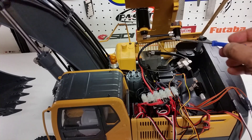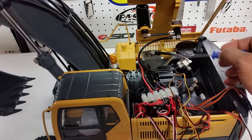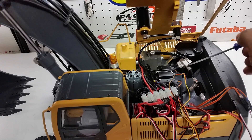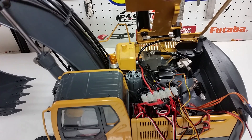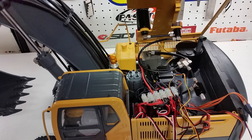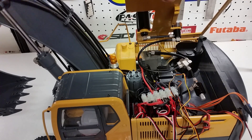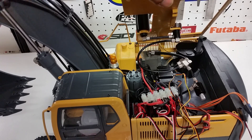The oil comes from the pump — you're either opening this valve and letting oil bypass to tank, or directing the majority of the oil into the control valves. The excess oil then returns to the tank. The pump also has a second discharge line that goes into the valves, and there is a return line connection on the side of the valve that acts as an equalizing valve, keeping pressure between the two sides almost the same to prevent jerking. In a large hydraulic circuit with high fluid kinetic energy you'd need flow compensators and pressure compensators, but it's not required in a small circuit like this — it's just an additional safety feature.